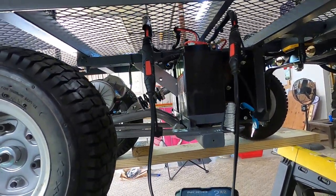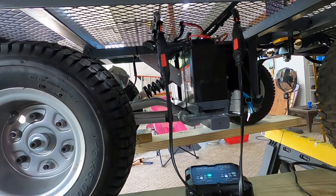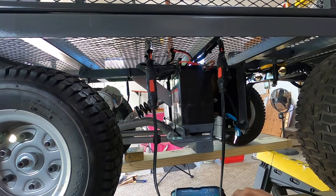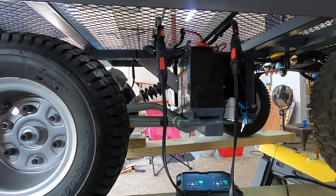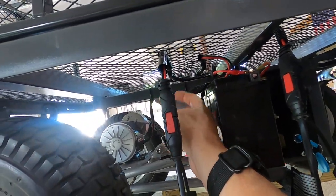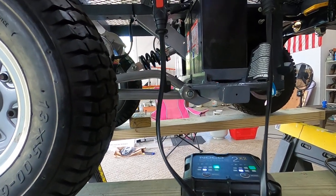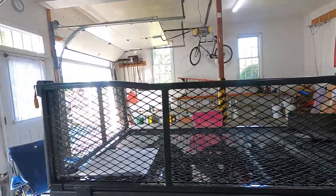Since this is a 24-volt system it takes two batteries tied together on a plus and minus. I didn't want to use the charging port on the ATV dirt quad controller because the cable and charger were really light, and I didn't trust it to charge these batteries — they're quite expensive snowmobile batteries. So I have a quick connect where I disconnect the plus and minus and charge them independently overnight with my own charger, then plug the connector back in and I'm good to go.